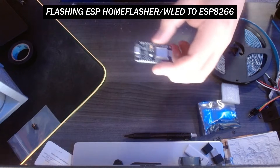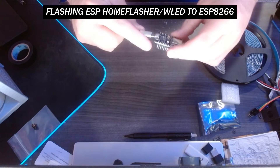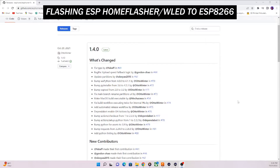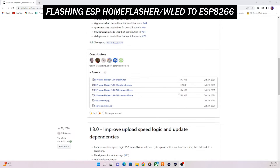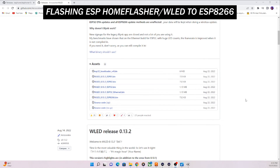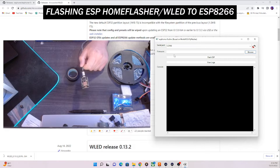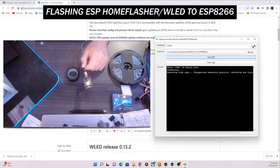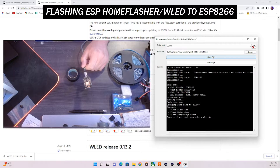To start, take your ESP8266 and plug it into your PC using a micro USB cable. When you plug it in, you should see a flash of blue light briefly on the microcontroller. Next, you're going to have to download the ESP Home Flasher as well as the latest version of the WLED software. The ESP Home Flasher is basically the software that lets you flash WLED onto it — think of it as flashing new firmware onto your printer via Pronterface. Make sure you select the right one for your computer. Links to the GitHub repositories will be in the description. Once that's done, open up the Home Flasher, select the serial port your ESP8266 is connected to, select the firmware for WLED, and click Flash ESP. Wait for the screen to say flashing is complete before proceeding.